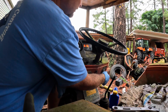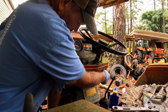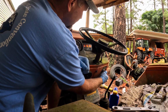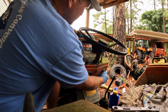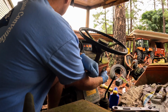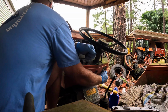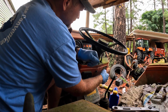So, got a little bit of a horn blowing action. It's trying. All right, let's see. Oh, nothing. Not a thing on that at all. Okay. At least the glow plugs work. You turn it back to the left, and they do come on. Let's see what happens. See if the glow plug light's right there. Glow plug light's supposed to go off. It may not be working, it ain't going off yet. We'll adjust for the length of time of this tractor not being in use, so yeah, still not getting anything.